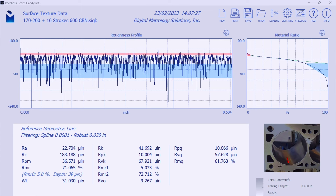We went through the roughing operation, went to the plateau operation with 600 grit CBN, and we checked all the finishes — everything's spot on and it looks really nice. All the rust cleaned up within a thousandth, so now we're at 4.066.